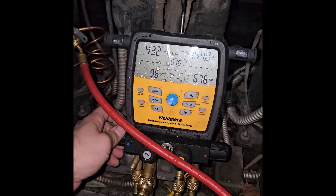We're going to go ahead and get ready to charge this guy up. I'll turn off the vacuum pump — you can still see it's holding. We turned off the system breaker and we're just dumping liquid refrigerant in from the liquid port, which has a dip tube going down into the high side. We're putting as much gas into the high side as we can, then we'll turn the system on and meter it in through the low side if necessary. We got the low pressure control on this one changed. The sight glass changed to green, the box is satisfied, labeled — everything is good. We're done with that one.